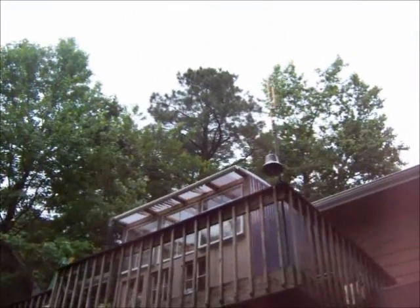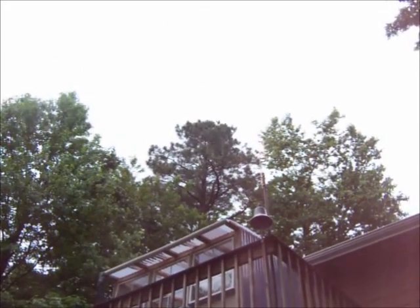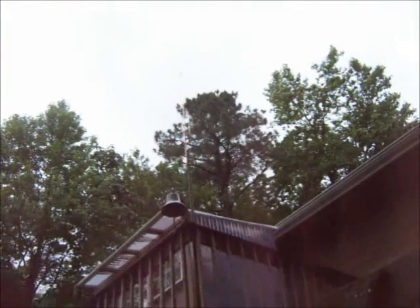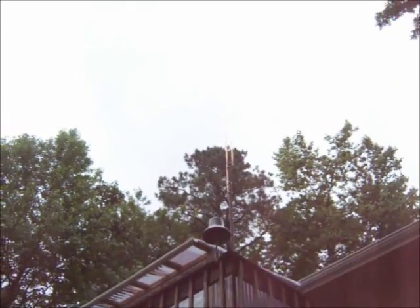That's all up and mounted. It's real solid — about 1.4 to 1.5 to 1 across the 147 to 148 MHz range. It's way off on 440, but it's been tuned for two meters. It's a relatively long cable run, which does suck up some of the output.